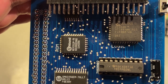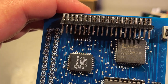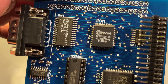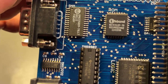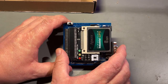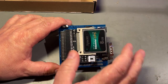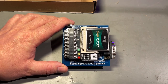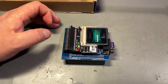I don't know much about this adapter other than it's fairly advanced. As you can see, it has a Xilinx chip — probably an FPGA — and it also has a Winbond EEPROM chip, so there's probably some code that runs on that one too. This one in fact emulates up to three floppy drives, serial ports, and comes with some basic extensions as well. I'll get more into detail about that when I actually use this in later videos.